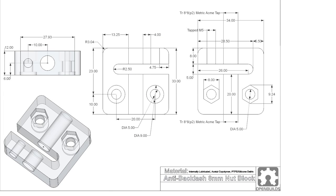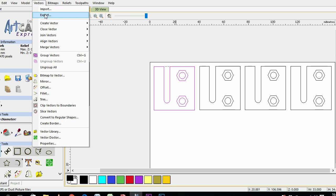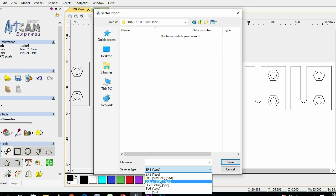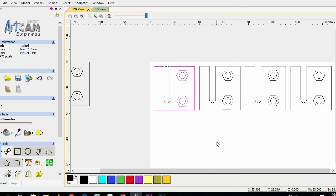There is a version available to buy which is made from Delrin, like the wheels, but I will be using PTFE or what is sometimes referred to as Teflon. This material is manufactured by the same company who produces the material for the wheels and it has the properties of very low friction and resistance to high temperature and chemicals which makes it perfect for the task.